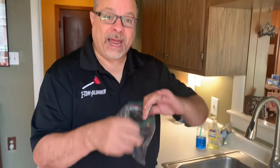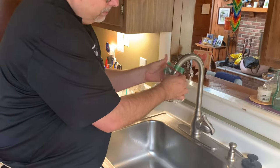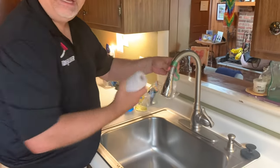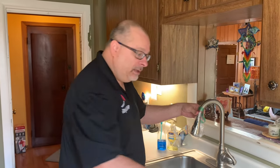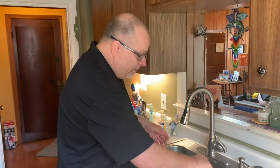There's actually an alternative to doing this using a plastic bag. Let's say for whatever reason you don't have a bowl around the house — you can put white vinegar in a plastic bag and wrap it around your sink sprayer, then take some string and tie it around the bag tight enough so that it holds for about an hour and a half. Then all you do is undo it, remove the bag, and pour out the vinegar.